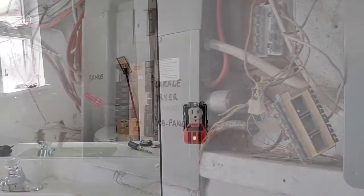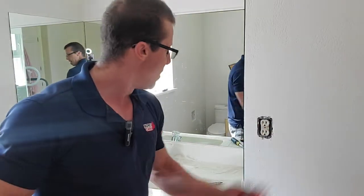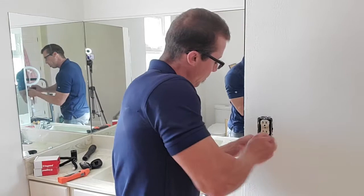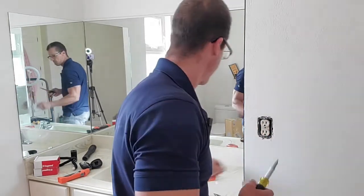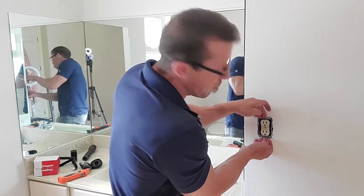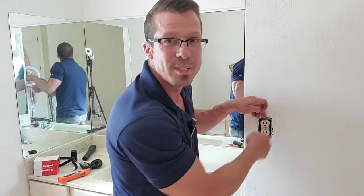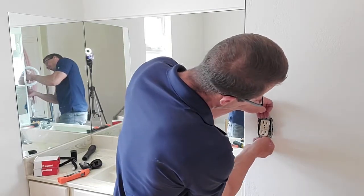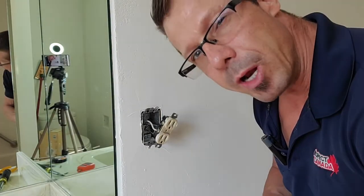The first thing I want to do is turn off the power at the panel. Now that the power is off, I'm going to take this outlet right out. With older outlets, there's a nice little square bit that goes in there. I like to pull it straight, because if this is a metal box and the screws on the side touch that box, fire can come out — it did happen before. Now I'm going to unscrew the wires and talk about them.